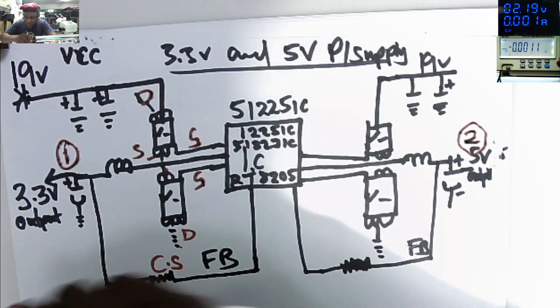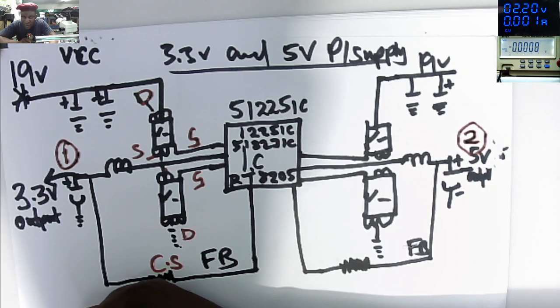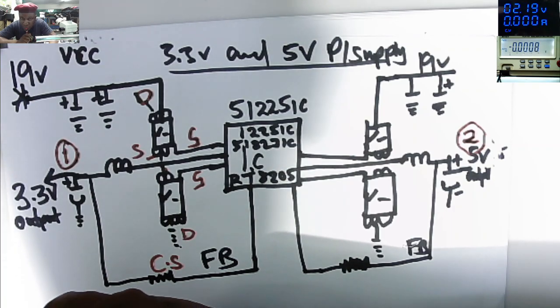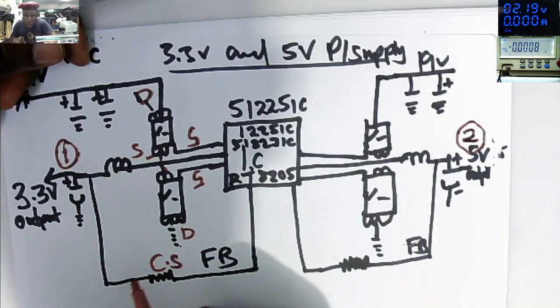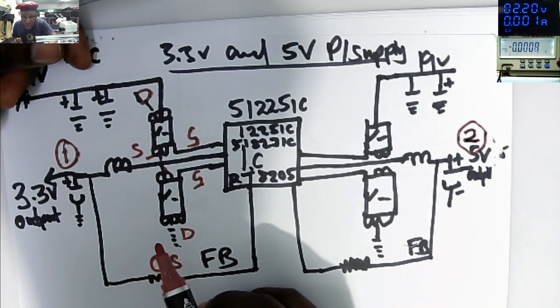And probably this chip is getting hot. You change the chip 2-3 times. Still the chip is getting hot. Obviously, if you see this chip getting hot, the next step you say this chip is faulty, and you are wrong, because this power supply is not outputting only two voltages. This power supply is outputting four voltages.